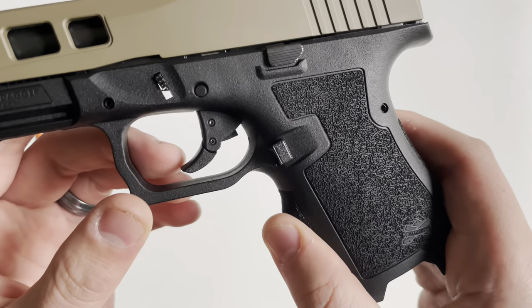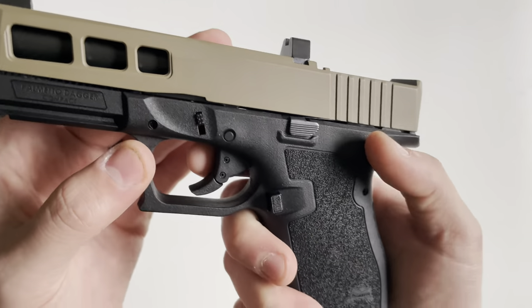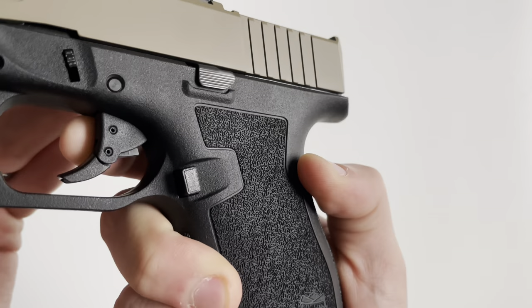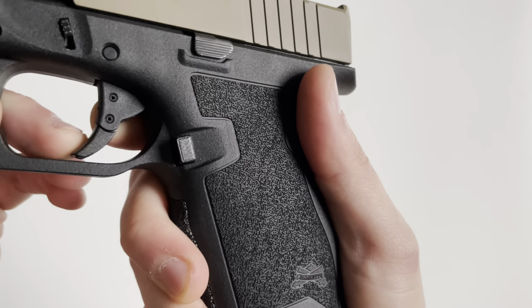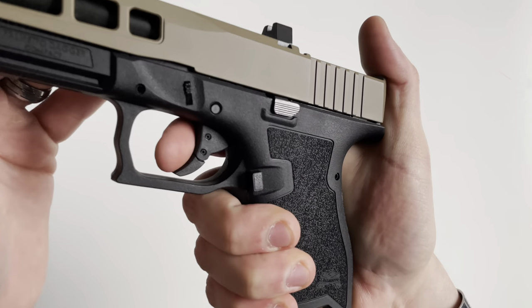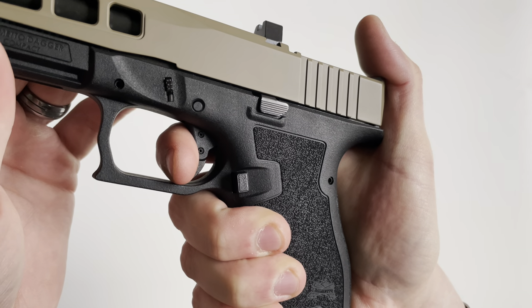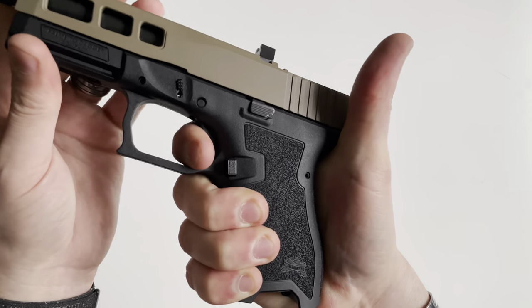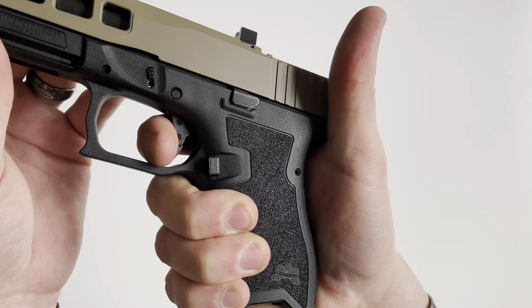The thing that's different on the Dagger is going to be the hinged trigger design over the blade trigger safety. If you attempt to fire it just from the top, you're going to get caught right there on the frame — you actually have to actuate this hinge in order to move the block out of the way to pull the trigger. There's all your play right there, you hit a pretty solid wall, a little bit of creep, and a break right there, and here's your reset — and the break.